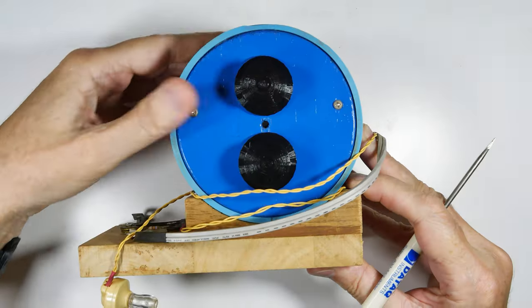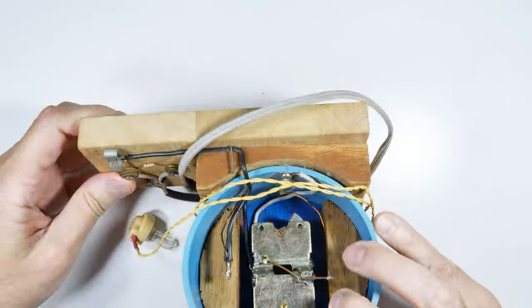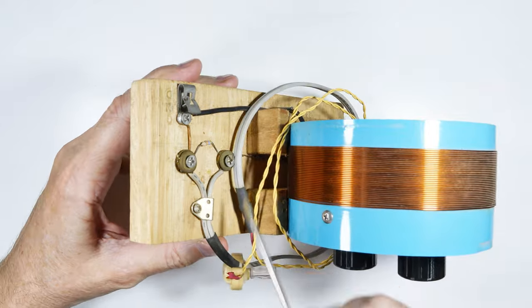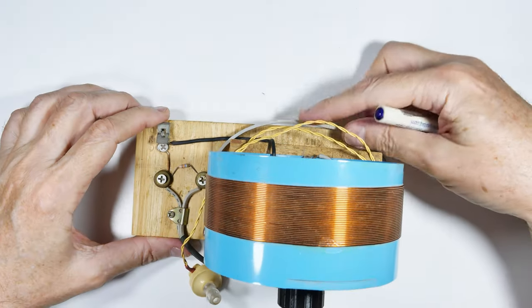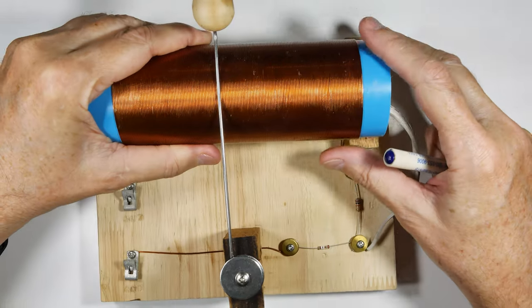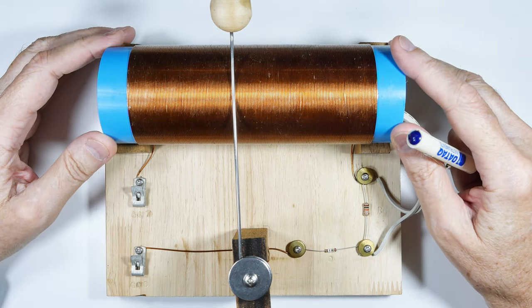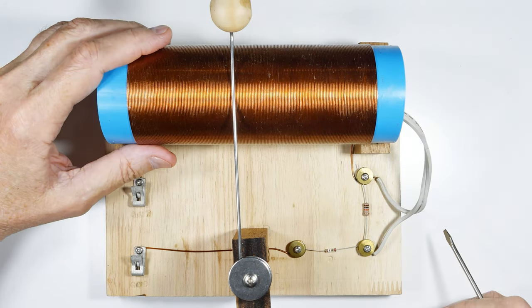I have built a dual-capacitor version of a crystal radio that works quite well — one capacitor to tune the antenna and one to tune the station. You can see them back here: one, two. It's got the detector crystal, the resistor for the earphone, earphone ground, and the antenna connection. Yes, this one works well, but I was looking for a single variable capacitor design because variable capacitors — I think I paid twelve dollars for the last one, and that's a lot. This single-capacitor version probably costs two or three dollars to build.